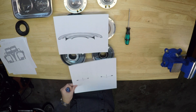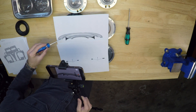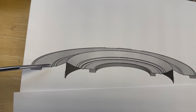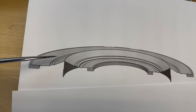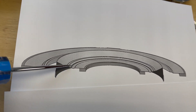You can see here that step. Here's the step I'm talking about — the other side of the step. So that's the surround. The surround here is just flat, and this is the step that separates the portion of the diaphragm that's going to work at the highest frequencies from the portion of the diaphragm that's going to work at the lowest frequencies.